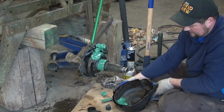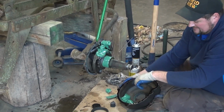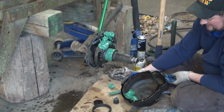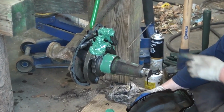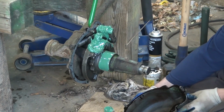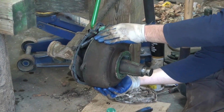Okay, we've taken our tube of cornhead grease and smeared as much as possible on top of the assembly, and most of the rest of the tube down in the bottom of the housing, taking care not to get it on the gasket surface. We prepped our gasket surfaces with sealant, as well as put the gasket on our housing. To make it simple, put 2 bolts in place just to keep the gasket from falling down. So I'm going to carefully and quickly install this.